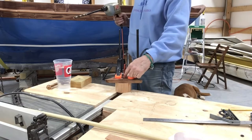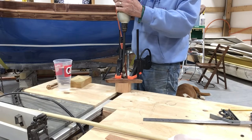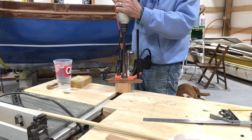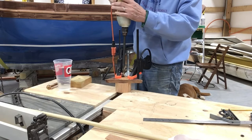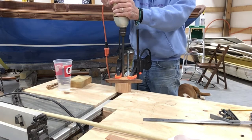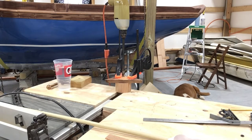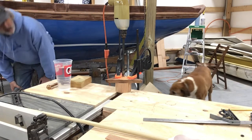I'm creating a drilling jig that I'm going to hold up against the lead keel so I can hopefully drill a straight, true, 90-degree hole. I'm going ahead and drilling out this piece of wood. Every once in a while I'm stopping and looking at it to see if it's straight up and down, looking from a couple of different angles. Yeah, we're right straight up and down now.